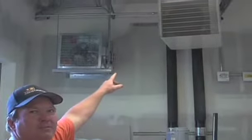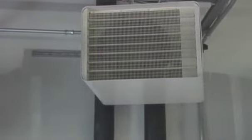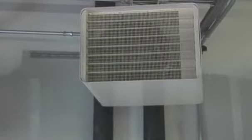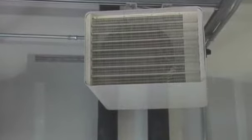This is a heating element that also adjusts by temperature. It never gets too cold in here. So it's basically to heat this room. And this fan here, when it gets too hot, will exhaust the hot air out. We set it to a certain temperature, according to the equipment, so if it actually gets too hot, this fan will blow the hot air out, and this fan will actually heat the room up when it gets too cold.